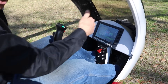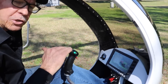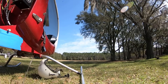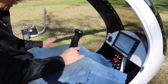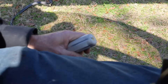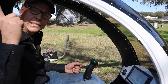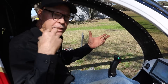Once we've started the start fuel nozzles, the RPMs slowly start to come on. The start nozzle is actually lighting each one of the run nozzles one at a time — there are five of them in there. You can see it on the gauges and hear it as the RPMs increase. On the collective we have a throttle, just like any other helicopter — increased throttle, decreased throttle. We have to control the RPMs of the engine, because if we hit all the fuel at once we could over-temp the engine, since it's trying to turn a 19.5-foot flywheel at the top plus a 40-inch flywheel at the back at the same time.